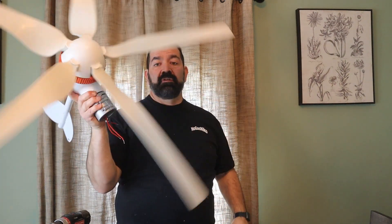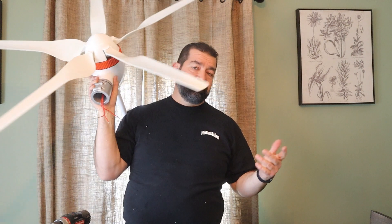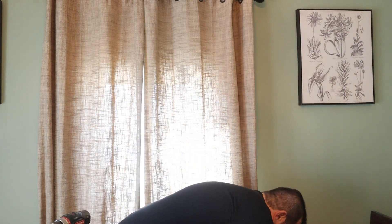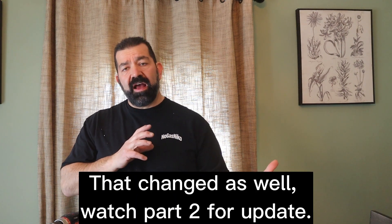It's completely assembled just like that. I'll take it outside and mount it on a two-inch rigid conduit — you can mount it on your roof or on a pole in the backyard. I'm going to use rigid conduit so I can run the cables through the bottom. I'll use antenna mounts on the side of the house — the kind used for TV antennas — run the pole up, then run the wire into the house where I'll have all my controllers, batteries, and inverters connected. Don't forget to like, share, and subscribe to see episode two on getting this installed.